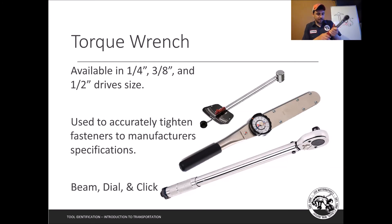The mechanical click version literally clicks when you reach your set torque. After you hear that click you can still keep turning, so you have to pay attention. If you have music blaring or headphones in you might not hear the click, and if you have gloves on you might not feel it either. So stay focused when using it.